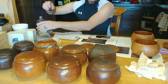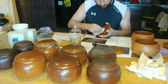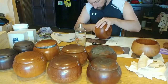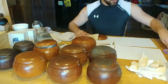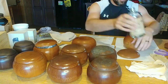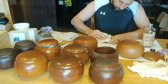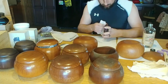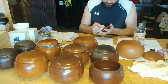I'm going to try something new and do a voiceover — we'll see how that works as far as sound goes. The first thing I'm doing with this refurbishing is to clean off the stripped bowls. I'm hunting old varnish that might not have come off with a stripper, just using some turpentine and a cloth that I cut up. I realized I was working on newsprint and that ink gets on the bowl, so I got rid of that. Then I tried the turpentine on the moldy bowls, and with just the cloth it wasn't quite coming up, so I set those aside for later. I ended up using steel wool on those.